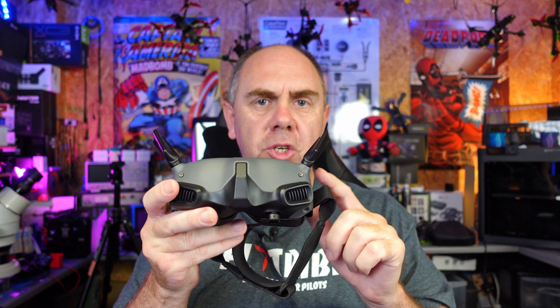Overall, the Flip G2s are not a dramatic improvement over the originals. However, that isn't to say there's no benefit. These antennas are dual polarized, so you'll have the benefit of transmit antennas on the Goggles 2 being both vertically and horizontally polarized — useful for people in bandos or throwing their aircraft around. In my testing, the results are very mixed: there are periods where I saw a benefit and periods where they didn't seem quite as good. I think there is a small gain in general everyday use, but what the benefit will be specifically in polarization-challenged scenarios is hard to determine — it's a very hard thing to test.